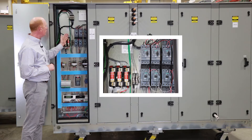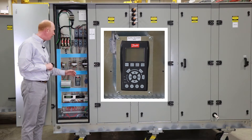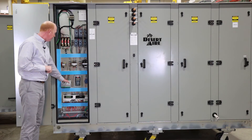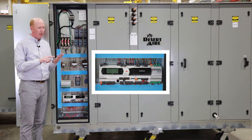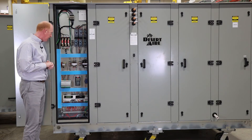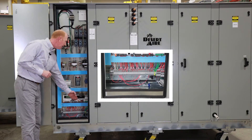Working our way down the panel: we have fuses, motor contactors for the compressors, and the VFD for the blower with a user interface right here in the panel so we don't have to make adjustments at the VFD directly. There's also a low voltage and phase monitor to ensure incoming power stays consistent. Expansion modules go with the operating control, and we can include BACnet, Modbus, or LAN as a communication platform to building automation systems or the fertigation system running the facility. At the bottom are the contractor field connections for ancillary devices, and room sensors are terminated at the gray panel at the bottom.